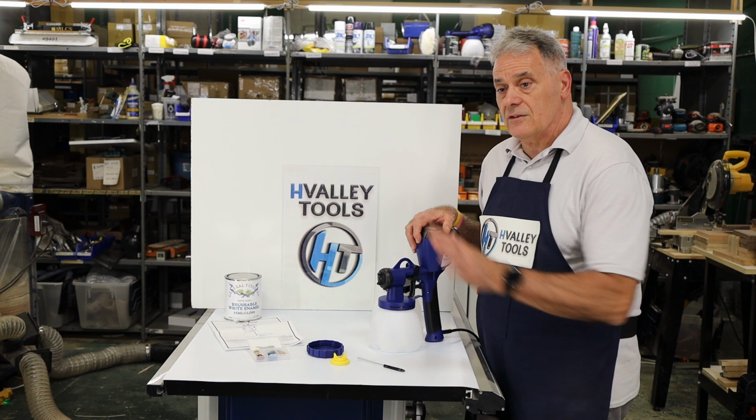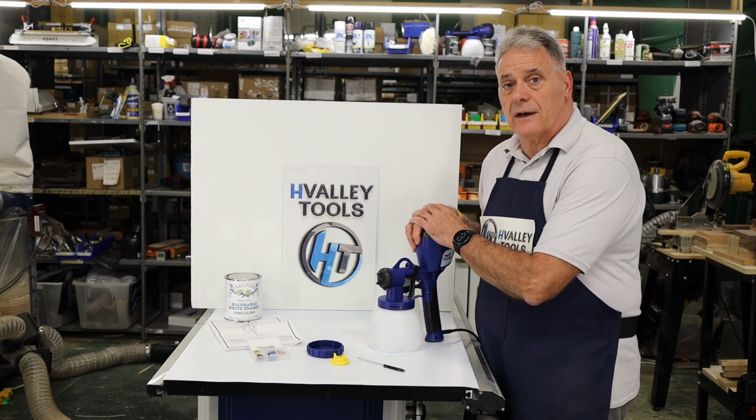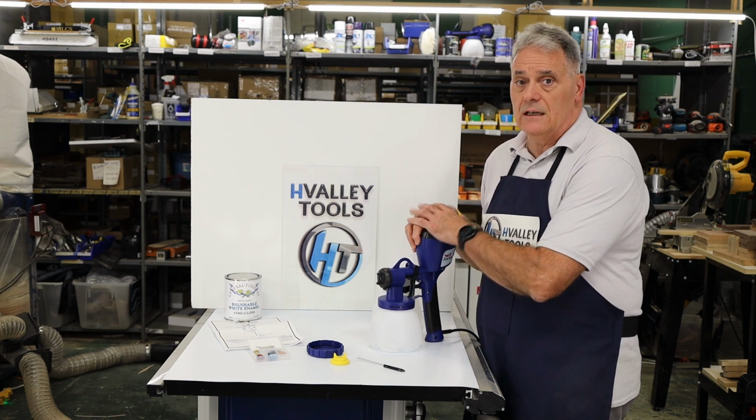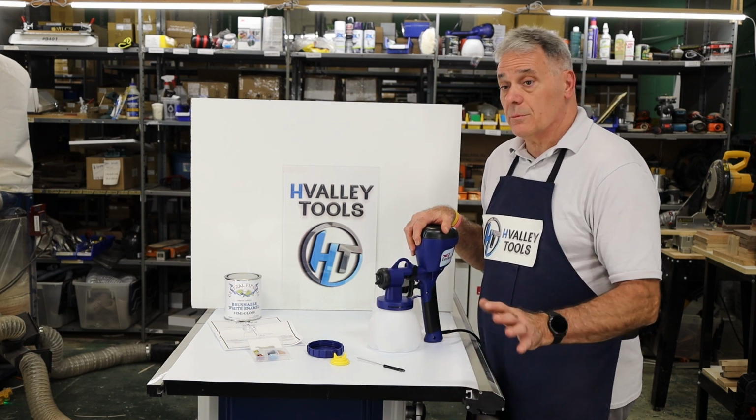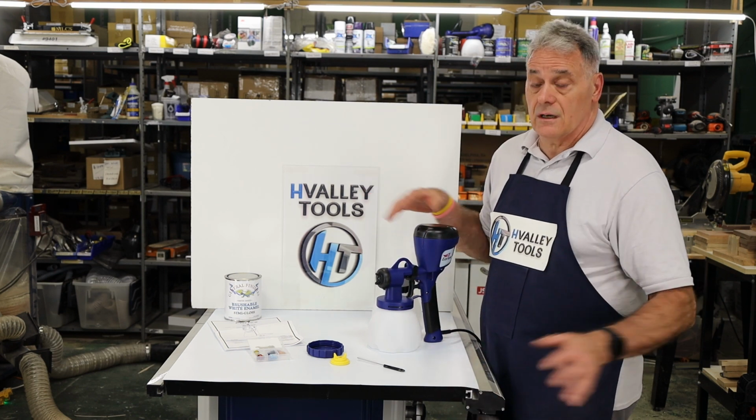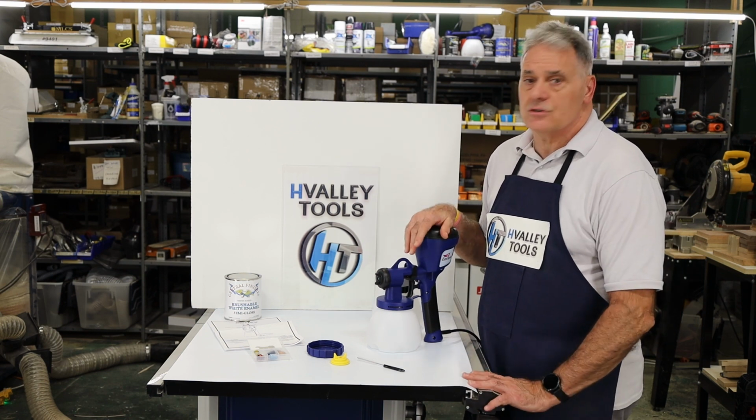The only limitation to this sprayer is you cannot spray true lacquer, okay? Because it will dissolve the plastic. Water-based lacquer works great. Water-based finishes work excellent. Oil-based finishes work great, just no lacquer.